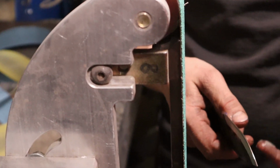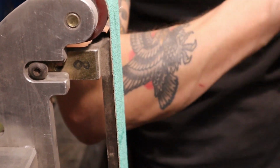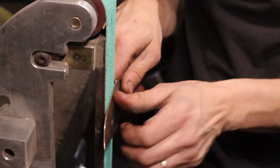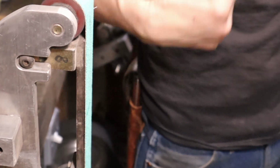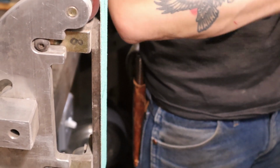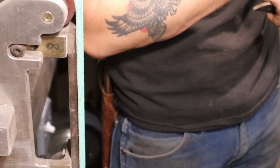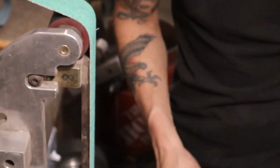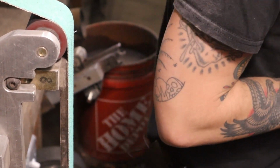It can be really tough to not move this, but one of the reasons why I think people a lot of times have problems grinding, believe it or not, is that they're gripping too tightly. It's not that they're too loose. So they're not allowing any feel of where this thing is supposed to be. Instead, all the way through their back, shoulders, arms, and fingers, they're white knuckling it. And so a lot of times if I can get people to shake it out and loosen up a little bit, they can grind better. I'm going to continue. And then another thing, I really try to keep the knife close in, keep my head really close into my work.